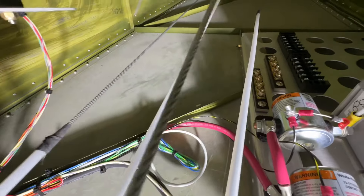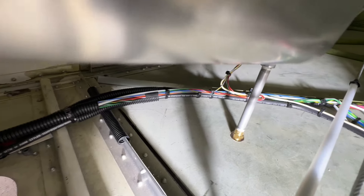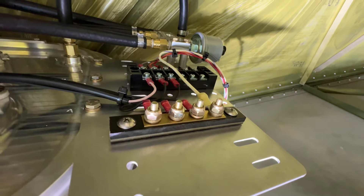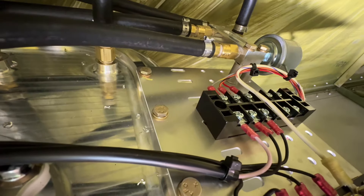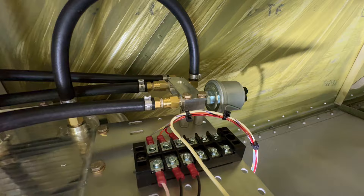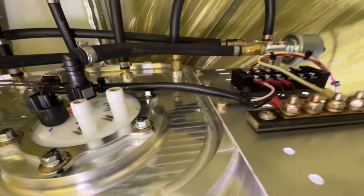We had our big bundle of wires — about 10 to 15 wires depending on whether you also do the flap motor and lights. We ran those back here and some were used for the fuel system. We wired up the fuel system — ground from the batteries, grounds for the fuel level, fuel pump one, and fuel pump two. We wired fuel pump one, fuel pump two, and the center unit for the fuel level. We also have a wire for the fuel pressure transducer. That's really the only change done to implement a rear battery setup.